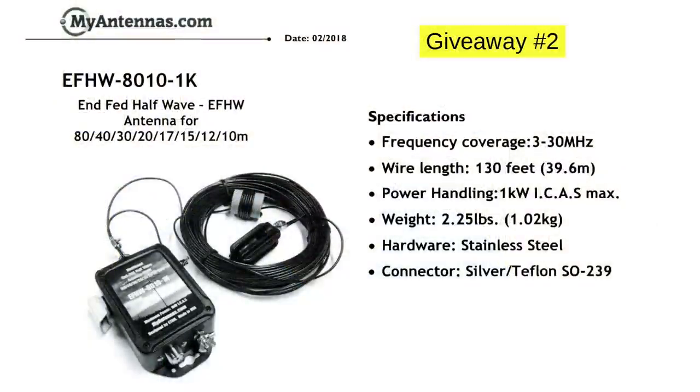I was extremely pleased with the results, and I'm happy to make this a giveaway. I bought this with channel funds — with money that you guys gave me. I've tested it, talked about it, shown you what I learned, and now I'd like to give it back to you. This is giveaway number two — giveaway number one was a book. It's going to be this antenna — a very nice antenna. I had it up as an inverted V. One end is the un-un, the other end was just the other end of the wire, with the ends down fairly low at seven feet and the center up about 20 feet. It worked really well.